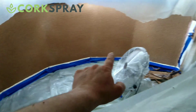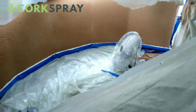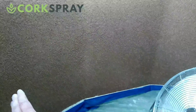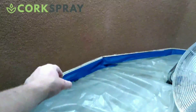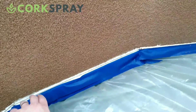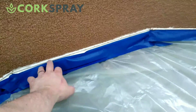As you can see, I've applied a cork coating along these five panels here on the bay window. The good thing about this product is it is extremely thin when compared to a thermo board, PIR board, or phenolic plaster board. You can see the bottom here at the skirting board — we're able to keep that in place, and that's how thin this is.